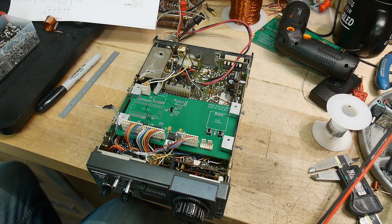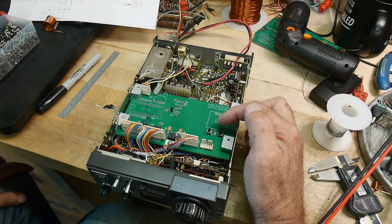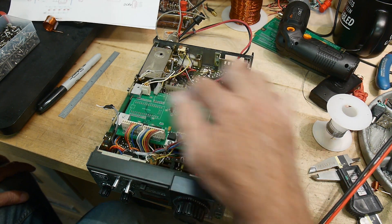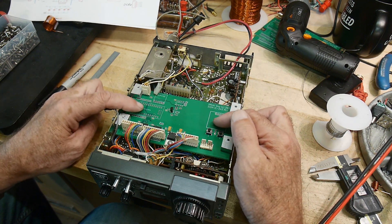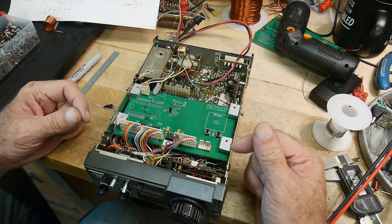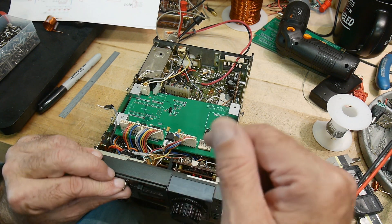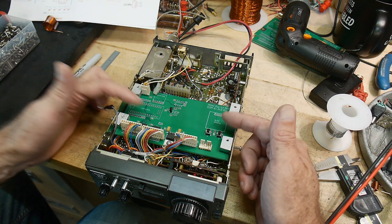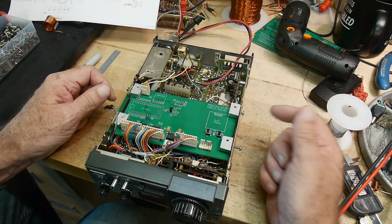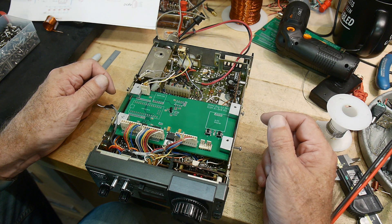The next step would be to start loading up some other parts. I'll put in the nano and the display next, and I'm going to write some software to talk to the front panel and get that working. Then maybe we can start wiring up some of the front panel switches — read switches, and maybe the rotary encoder. We'll do all digital stuff first and try that out. Then a later time, I'll put in the DAC and see if we can output some voltages.